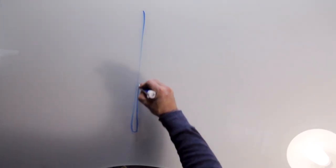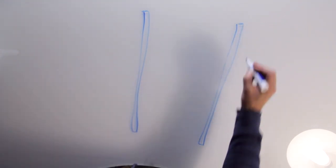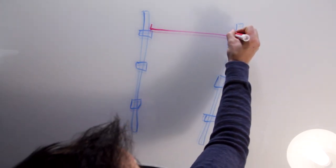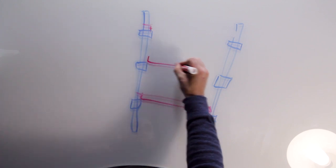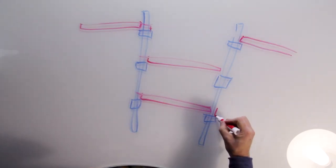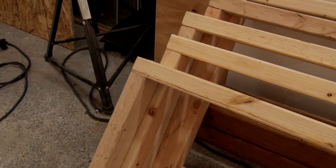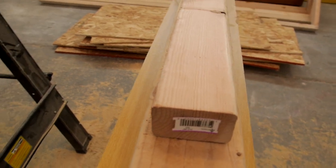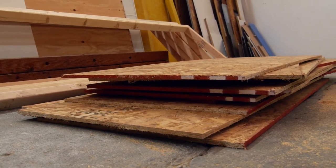Unlike my other shelving unit, I wanted this system to be adjustable. Instead of bolting everything together, I wanted the shelves to float between the support posts. Small brackets running down the length of the support frames would support the shelves and give me multiple mounting options for storing larger or bulkier items. To do this, I would brace the 2x3 frames with a number of 2x4 shelf supports. The wider 2x4s would stick out a fraction of an inch beyond either side of the support, providing a surface for the edge of the shelf to rest on.